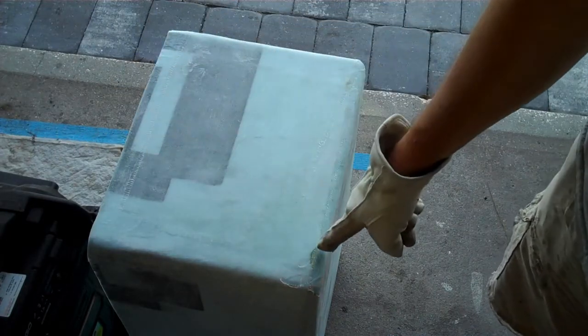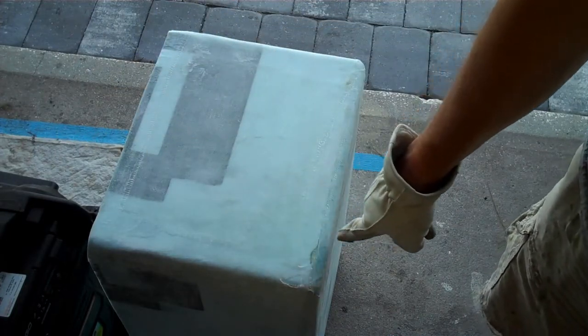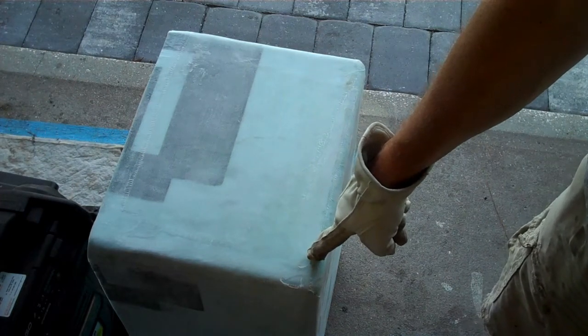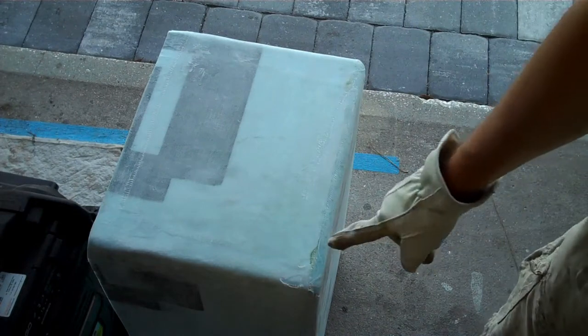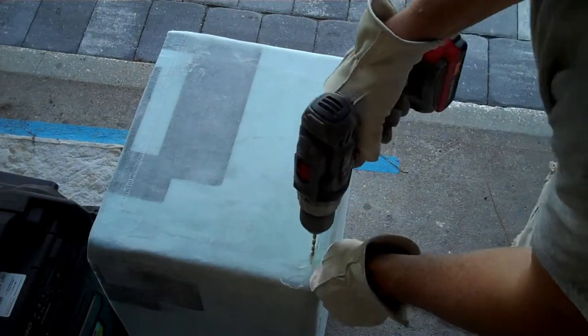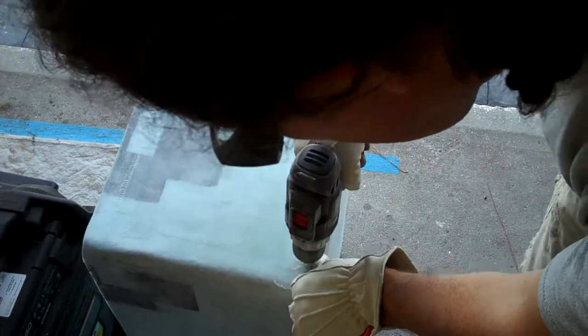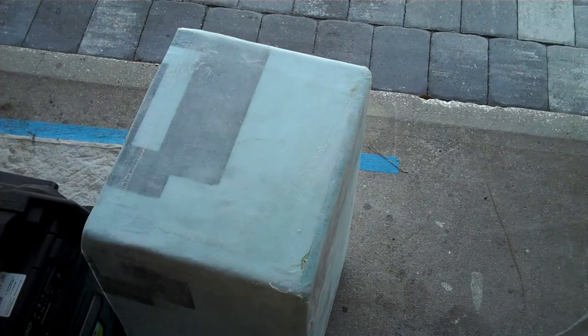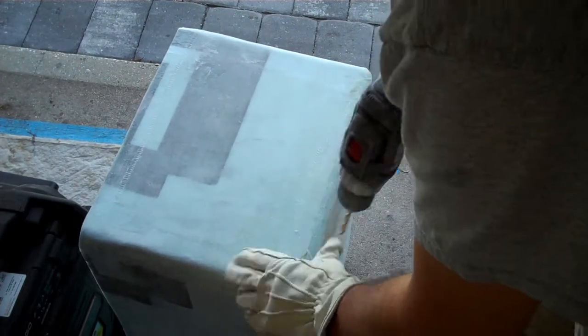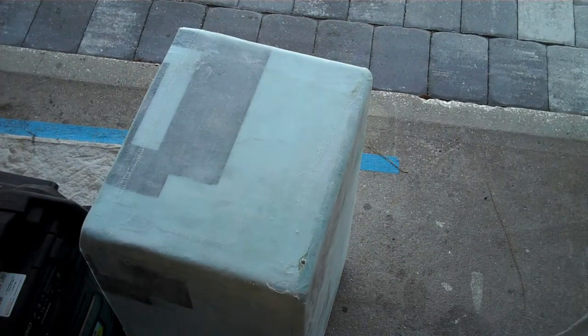This particular piece of foam had a little inclusion on one edge, so I've decided to make that into a feature. I figure it's probably good to have a hole in the bottom of this drawer in case water somehow drips in - it shouldn't if the bench seat is properly watertight, but maybe when the drawer is open and it rains or something. I'm going to have a hole in here and go right through that inclusion. I've put fiberglass on both sides of it, drilled through the two layers of fiberglass, and I'm going to make it a little larger. I'll be putting some more epoxy and fiberglass down here, coating all the foam with epoxy and leaving a hole with epoxy all around the inside - that'll be my drain hole.